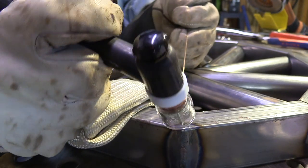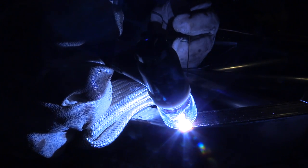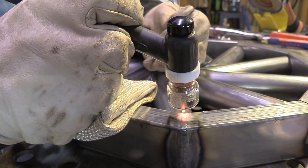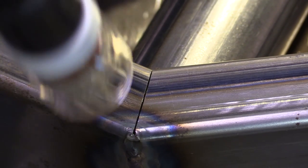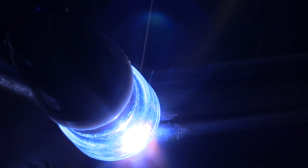This joint doesn't seem to have any gap in it at all. I'm using 0.045 ER70S-2 wire. I could use one-sixteenth, but 0.045 is a really good choice for this particular thickness. You typically won't find it in welding supply stores — they usually go down to one-sixteenth — but order some off Amazon. It's worth having a pound or two of 0.045 ER70S-2 or ER70S-6; both are pretty much interchangeable, and the size is the main thing for this job.